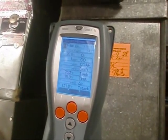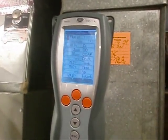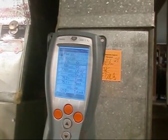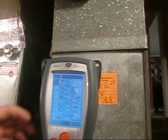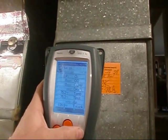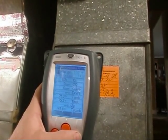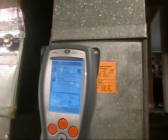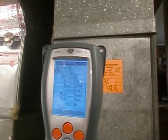Okay, where we at, Eddie? Alright, O2 is the top here, so we're going to watch this one. It's at 20.8 right now. And she's dropping. And that's the one where we dropped to 8.4. Yeah, plus I'm kind of flabbergasted right now. Alright, so the blower's going to be kicking on here. Actually, I would hit save once the blower kicks on. Okay. We're at 8.3, 8.3. As soon as the blower kicks, that'll be where we're starting at. So 8.2, I just saved it. Okay. Go ahead and print it. And we do not want to rise above that 8.2. And here we go, taking off to the frickin' races.